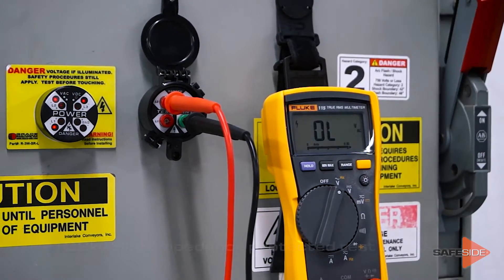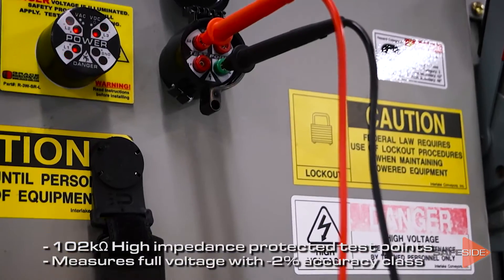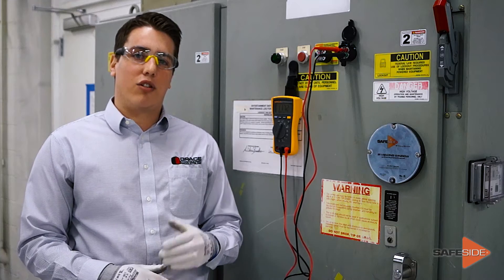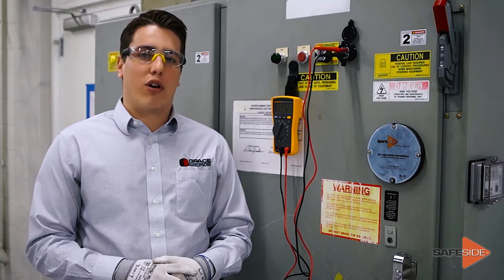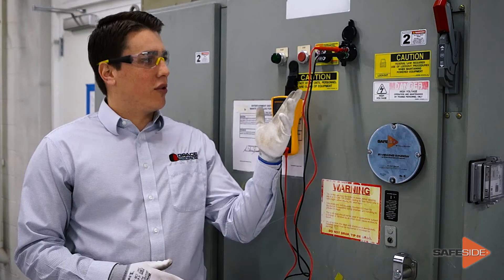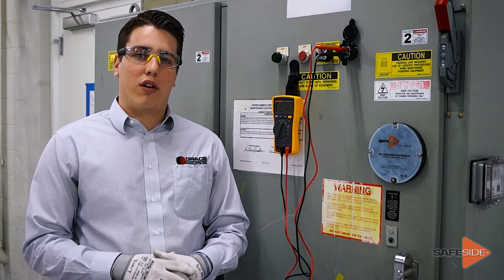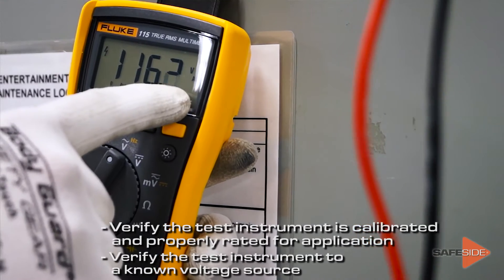It is protected by high impedance, so there's a 2% reading error. If your system is running at 480 volts, the current at the device is limited to 4.7 milliamps, and your volt meter might be reading 470 volts. For demonstration purposes, our R3MT is directly wired to a 120 volt outlet, which is why our volt meter is reading 117 volts.